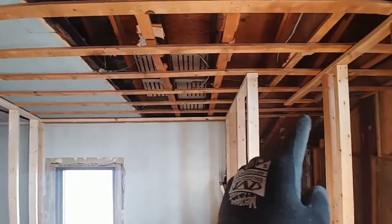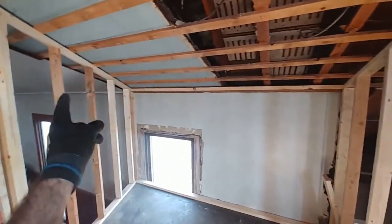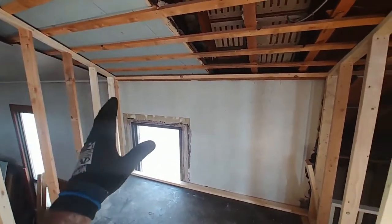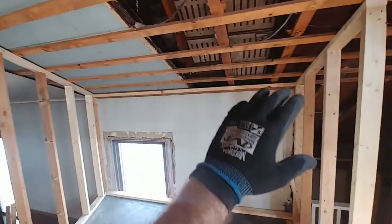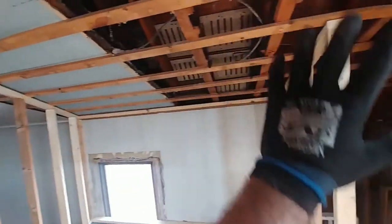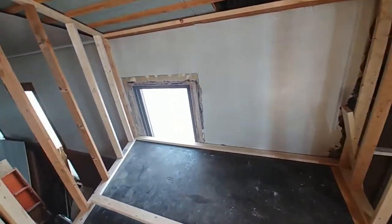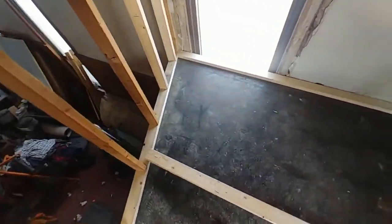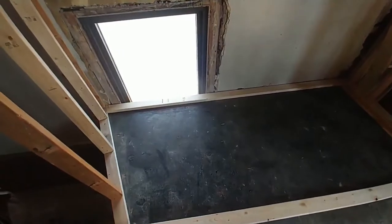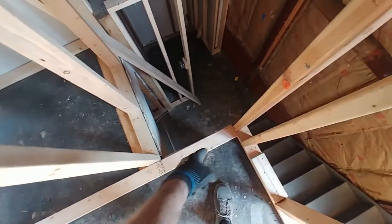No, but the end treatment for that piece is going to be a compound miter. The end treatment for every stick that goes in this wall, every stud, will be a compound miter. All the kings and cripples across the top of the door is a compound miter. And then when you get done, the pieces of drywall that you have to make for the face of this on the outside and the in are relatively complicated. Nothing the drywall hanger can't make, but they're not square cuts with the T-square. You can measure and lay them out. So it's going to save us all that custom fussing around for me to mitigate that problem right here.